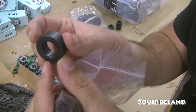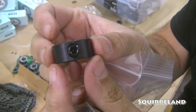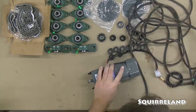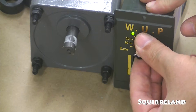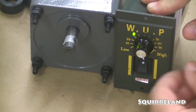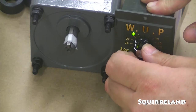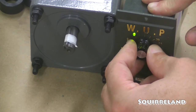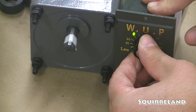Next I have 10 5/8 inch bore collars with set screws. Lastly I have a 60 RPM variable speed motor that runs on the standard American power of 110 to 120 volts. This little guy is a reduced gear motor, which means it has quite a bit of torque to it, and I'll definitely need that torque to make my rotocaster run smoothly.